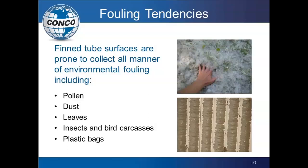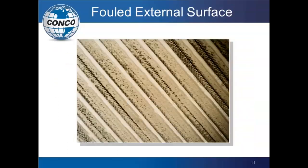We're beginning to limit the amount of air available to go through these fins. We've already got the problem that air is not as efficient as water for transferring heat, and now we are limiting how much air can get through the unit. Looking at the picture, in the upper right-hand corner you can see that some air is still getting through — fouled but not blocked — but toward the center bottom, those fins are completely plugged. Airflow has actually stopped, and you have lost all ability to dissipate heat through those fins.